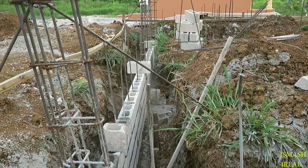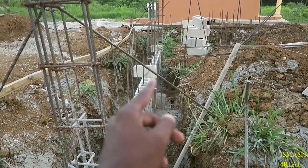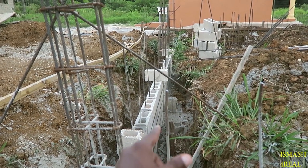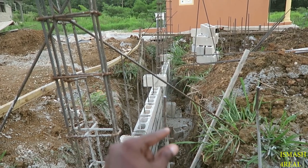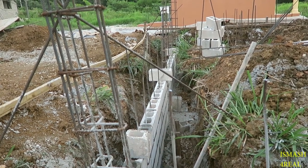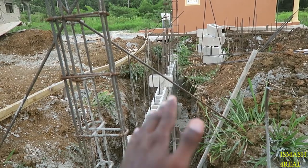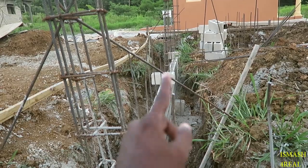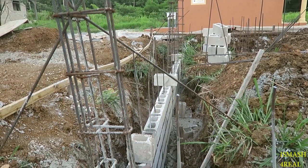In this foundation, I have a step up, so with our cranked steel, we're going to try to catch back the 2-inch difference in the spaces between the blocks. But masonry in particular never gets to that, so we might crank the steel or make them separate when we put in the bar in between.